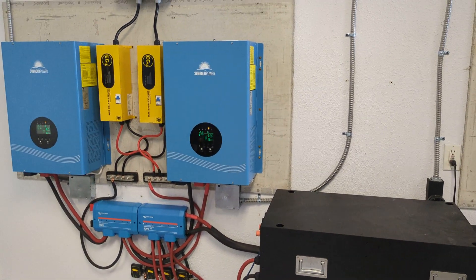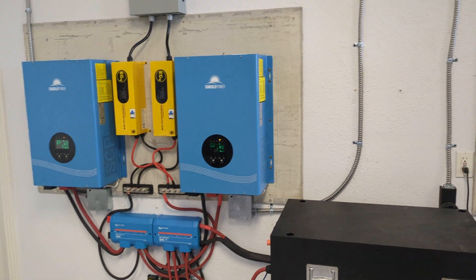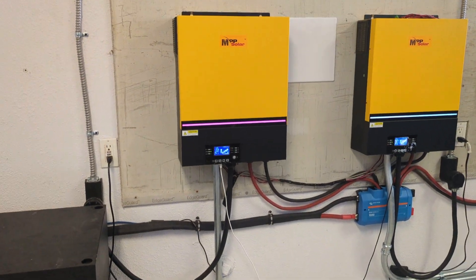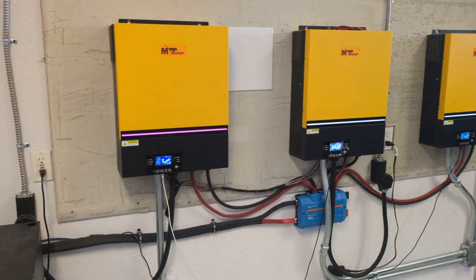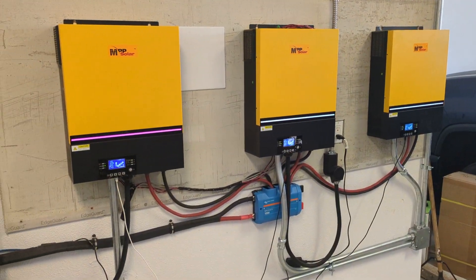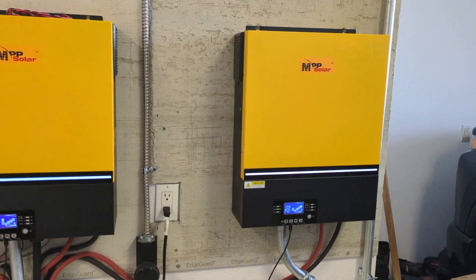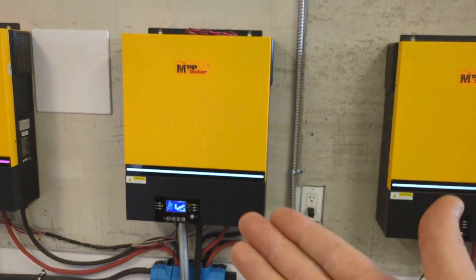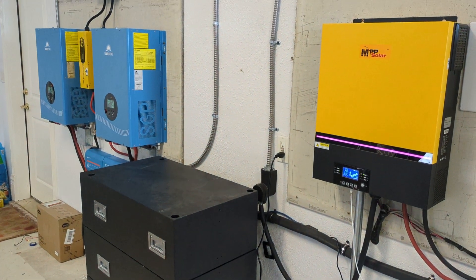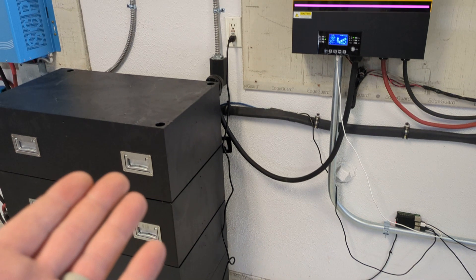Because your loads are always powered off of battery and always on those inverters, you get very nice, clean, smooth power. It doesn't matter if the grid drops out while it's on AC power — it's literally always drawing from battery. This kind of system is going to be extremely reliable for a very long time, just predicated on the fact that all these things are battery chargers and all of those things are inverters. I'm not using the MPPT charge controllers inside of those inverters. The battery is just a buffer for your workloads.